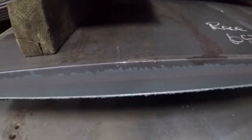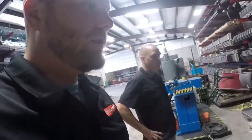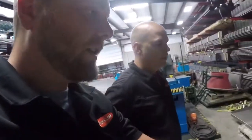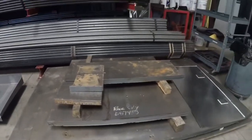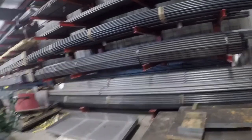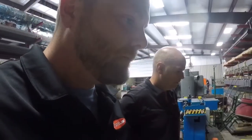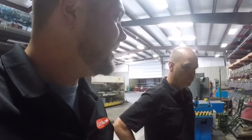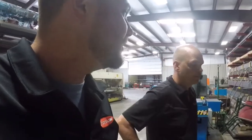Yeah. 2-inch steel plate. Are you cutting this all local, or does it come pre-cut? No, we cut that. That's oxy fuel cutting right here, the 2-inch. There's some stuff around here that we've run through the water jet, and the water jet does quite a bit nicer job. But we also use high def plasma. Yeah, the nice part about water jet, you don't have the heat distortion or heat affected zones. Right, and it's really good on aluminum. The business was started doing steel.